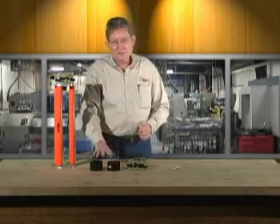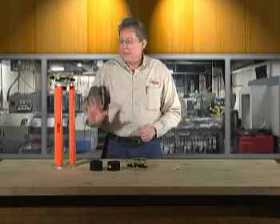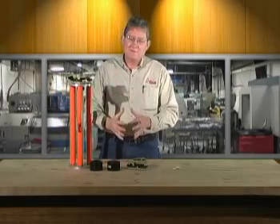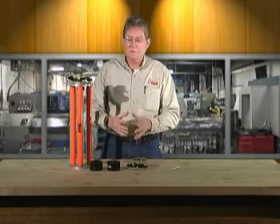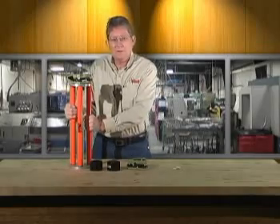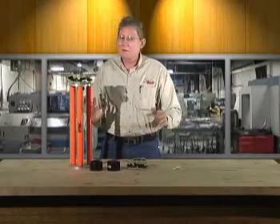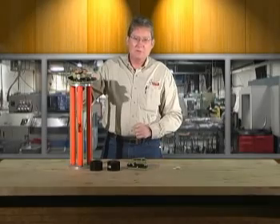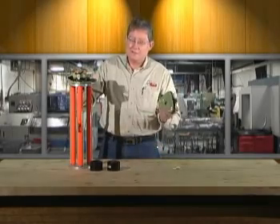To calibrate and to use these, you will need an instrument stand. A lot of the surveying shops have an instrument stand, solid, bolted to the floor. Or a tripod if you're in the field — an instrument tripod works just as well. And you'll need a Tribrac to help adjust the one that you are adjusting.